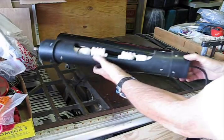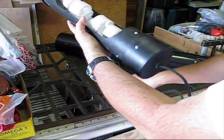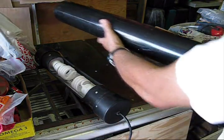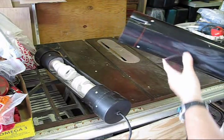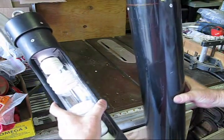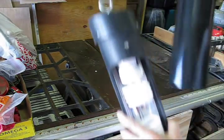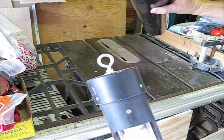Here's our finished lamp — the two caps on with the eyelet at one end and the cord at the other. Now we're going to work on the stand and storage unit. I got the 4-inch tube, cut it a little longer than the lamp, and put a wooden plug in the end about 2 inches in from the end. There'll be a slot for the cord as well. This is going to stand up, and what you do is slide the lamp in like this — that holds up your lamp as well as allowing you to store it in this end.